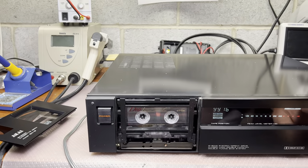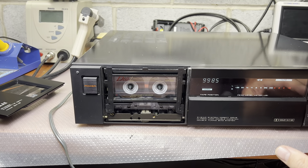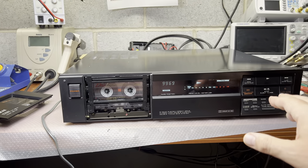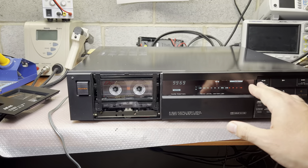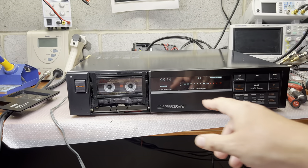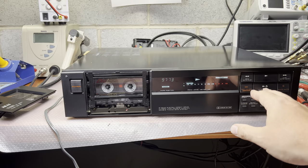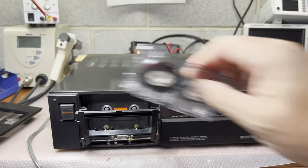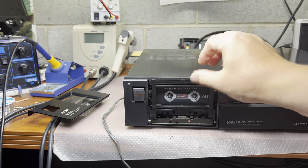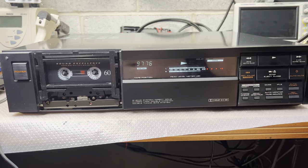Let's see if it really works with the tape. Fast forward, rewind works fine. Left channel has something, nothing on the right. Let's find a different spot on the test tape. Normal type, okay now we have something on the left channel. Let me install a tape I'm 100% sure has music recorded. Here we go, we have a signal.